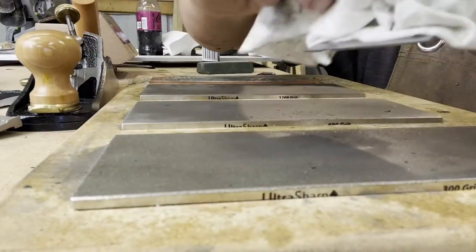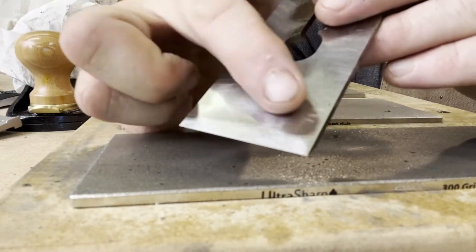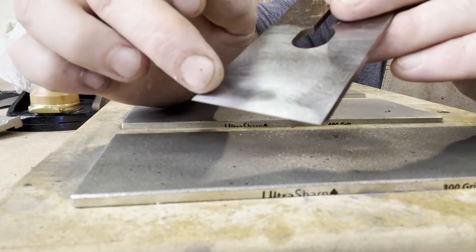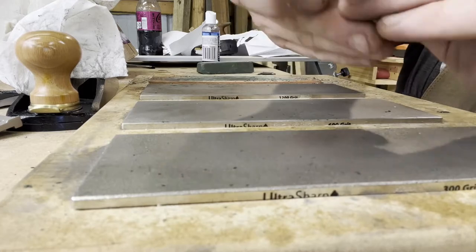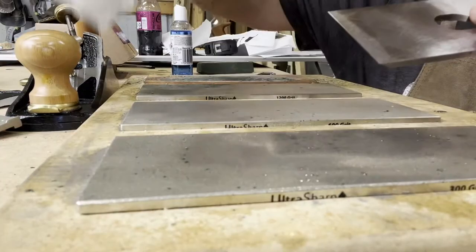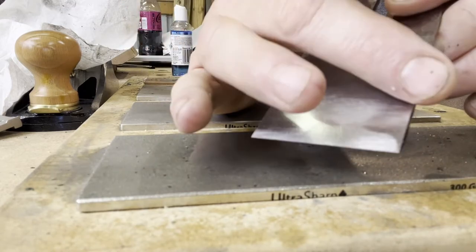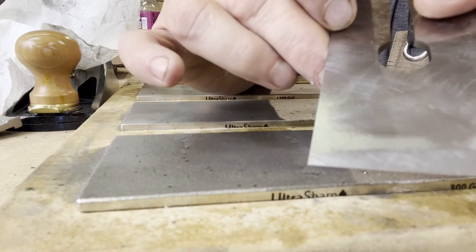When we take a look at the backside of the blade, we want to see where there are scuff marks. We can see some scuff marks at the top, which is fine, but what I'm really concerned about are scuff marks running across the entire length of the blade. I still have a little bit of area that needs more grinding — I want to see an even scuff mark running across the entire length. Now I'm getting closer; the scuff marks at the top are getting closer to the edge, but there's still a little nick I'd like to address.